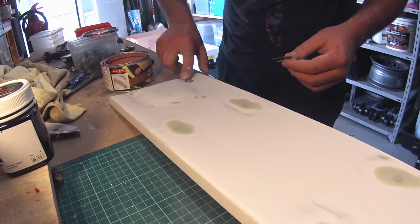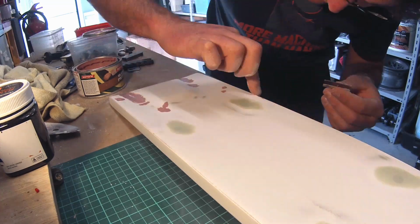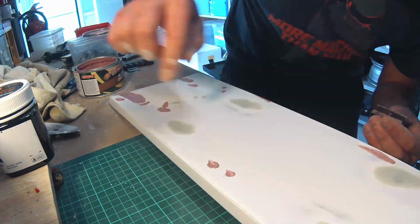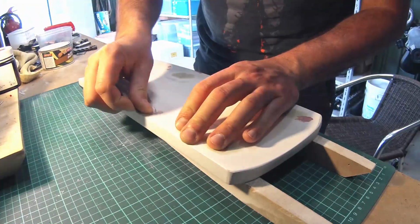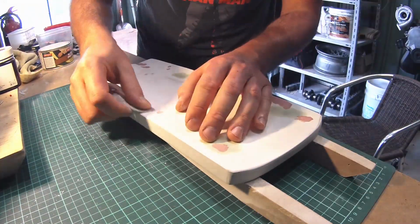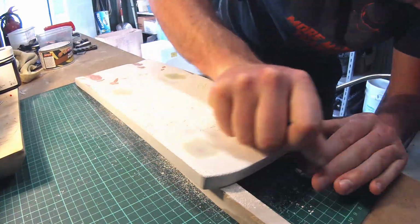But for the meantime, just applying some last finishing here, just with some blade putty, just to get rid of any little pinholes and things like that, because it is important to get that surface really, really nice and smooth. Having done some priming on there as well to seal that MDF, and just sanding it down by hand so that it's as smooth as it can be.